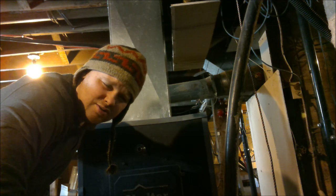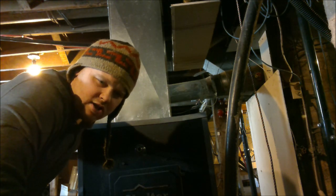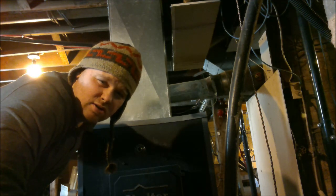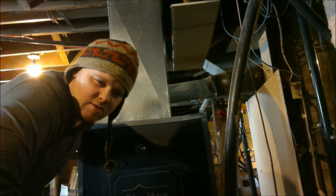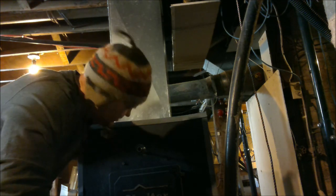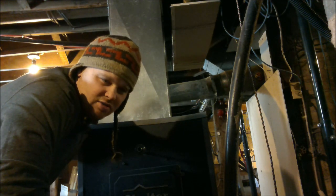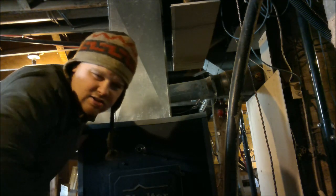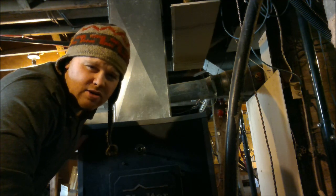It's important to pull the clinkers out regularly before they clog up the airflow too much, because once that happens and if it gets really cold, you'll have a heck of a time trying to get your stove up to a proper temperature. It's really hard to pull them out when the fire temp in there is 350 degrees or higher and it's full of coal — you can't exactly just reach down there and get them. So the time to pull them out is in the morning when the fire is very weak.